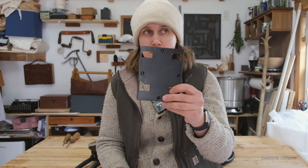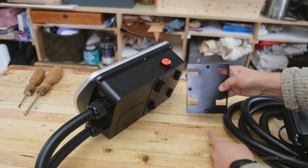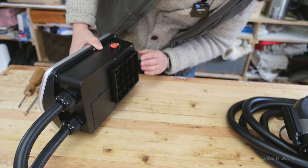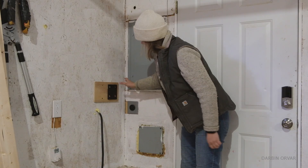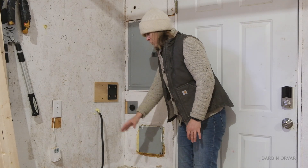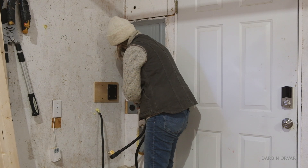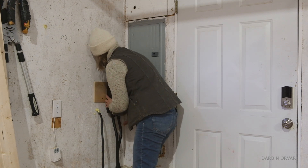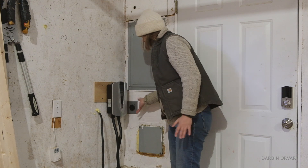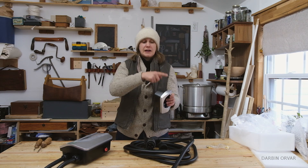This is the bracket that this comes with. You install it onto the wall and then hook the charger into place. I've got this bracket on the wall right here — this is where my NEMA 14-50 plug is, so I have the charger really close. You want to make sure you install it close to the plug. We pull it down and it's all connected. Now we can actually plug it in, and there is also this holder where the cord wraps around.